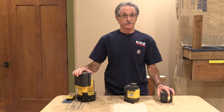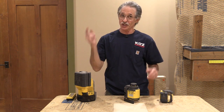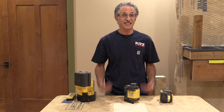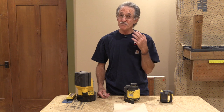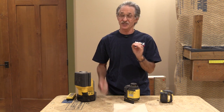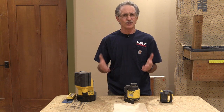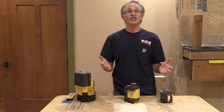I've got three lasers here. Which is the best for you? That all depends on what kind of work you do and how accurate your work has to be. If you're working in tracked homes or apartment buildings, you don't need dead-on precision. But if you're working in mid-level homes, accuracy and precision might be pretty important. And if you're working in high-end homes, then you need to be dead on. It's not just about the type of projects you work on — it's also the distance that you work over. So let's look at these lasers.